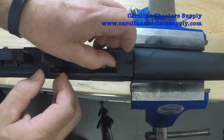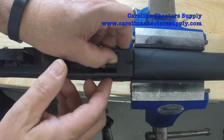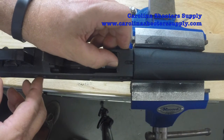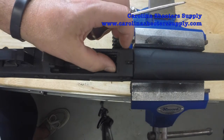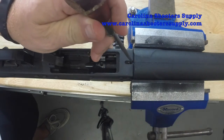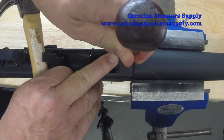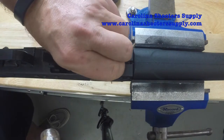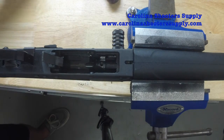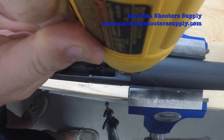With the installation of this plate, the hole where you insert your magazine becomes a little bit smaller — by about an eighth of an inch. With the plate installed, we're just going to mark that spot, then drill and tap to install the plate. Push the plate as far forward as it'll go. There's a lip that it's going to rest against, so just get it as far forward as you can, then mark the spot where you want to drill and tap, and mark it with a punch.